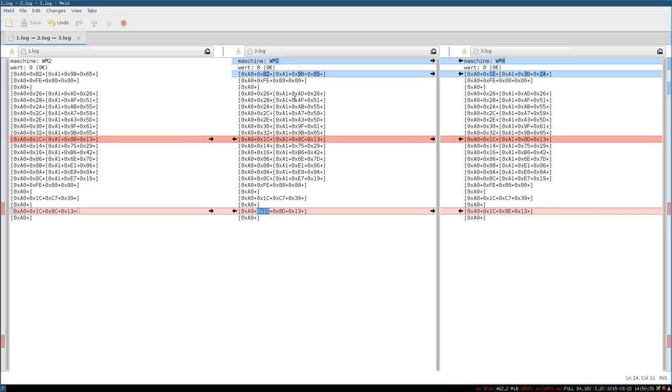I didn't know that when I looked at I²C, but this is a classic example where actually the device, the EEPROM address is selected here, then you write at which address in the EEPROM you want to read or write data, and you either read the data by using the second transaction, or you write the data just by writing additionally to it.